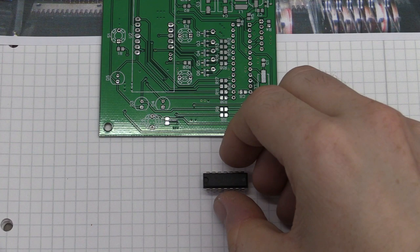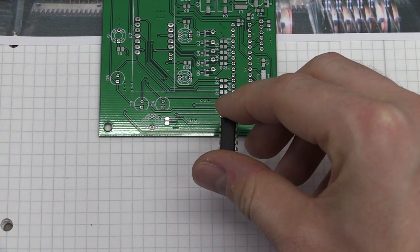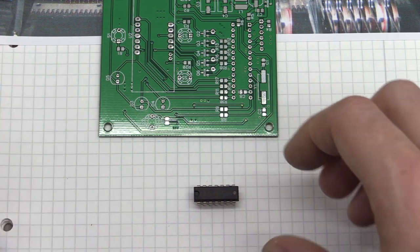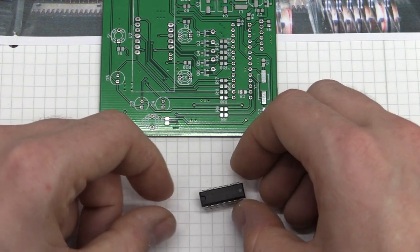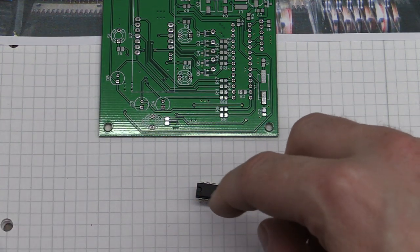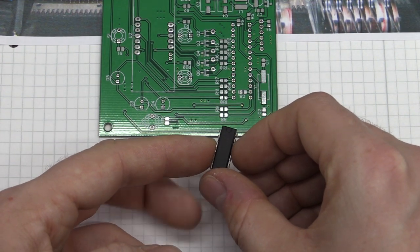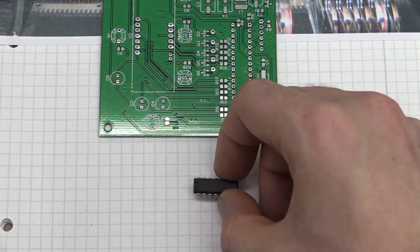So that takes care of picking up the component and rotating it. That might work for very big parts like ICs with large lead span and so on. But what if your component lays a bit crooked in the tape? That means you pick it up like this and you rotate it 90 degrees. So it's a bit off like that when you try to place it.